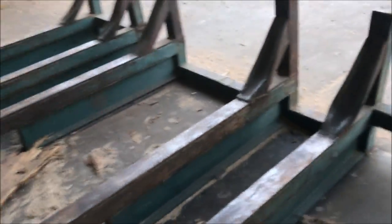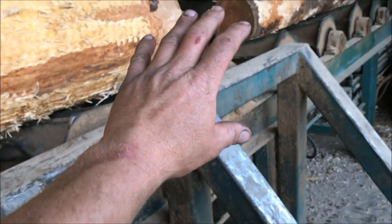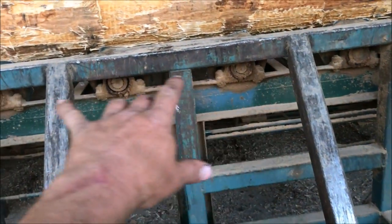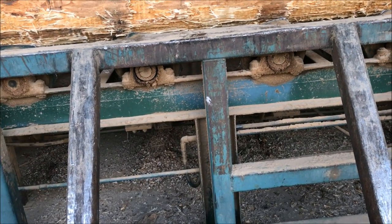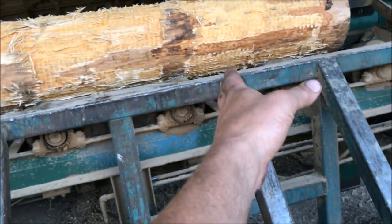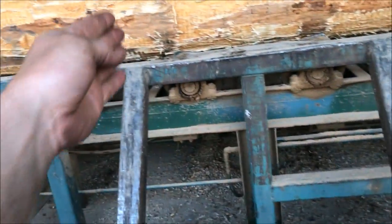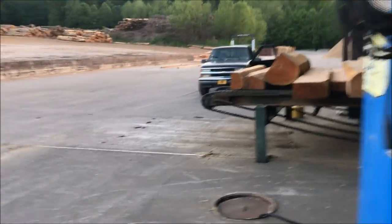Well, what about this? Okay, what if the ones that's up here around the clamp stops back here? Nope, because that'd get you crossed up. You just have to have your chain conveyor made right for where your loader clamp comes in. That's all there is to it. See? And you have a sprocket over here, sprocket over here, and nothing in the center where the chain... And then I'll have to make them tail sprockets, adjusters, like I did them adjusters down below, to where you can't destroy it.